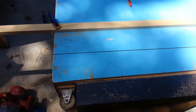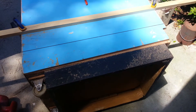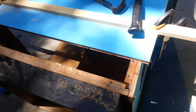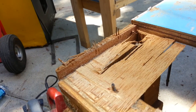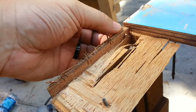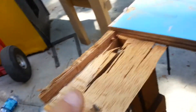We went ahead and cut it, and the line went straight down - it looks good. Next we're going to pry up the piece. Got it all pried up. This side we can clean up with just a razor blade - it's literally paper thin. Got a couple of screws here we need to take out from the inside. Back here there's a little bit of a problem - the original cabinet had a mortise and tenon joint where this would fit in, but you'd have to cut it so small, like an eighth of an inch. So I just cut it flush straight across.